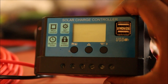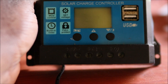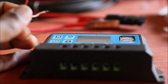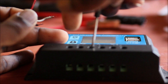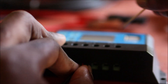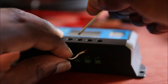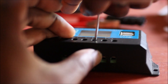I'm going to show you how to set this up, and we are going to put the panel outside as well. There is a sequence when connecting your solar charge controller: you have to connect the battery first — connect the positive wire first, then connect the negative wire. The solar charge controller is now connected.